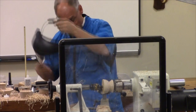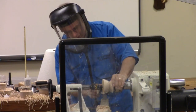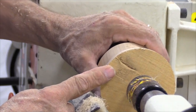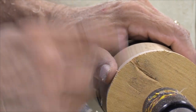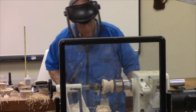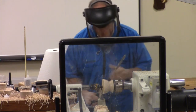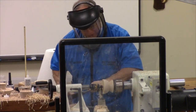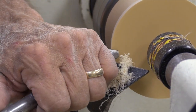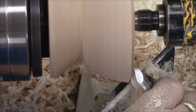Now the top of this piece, I need it as flat as possible. I can see from the side camera I've got a defect there and I've got to get that defect out. I can work a little bit here with the tail stock up, and I'm just going to do little push cuts in and bring the speed back up. A push cut will give you a cleaner cut because it's pushing on the side grain. That should get me below it.